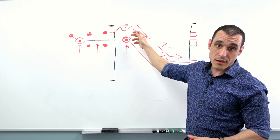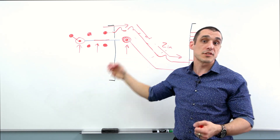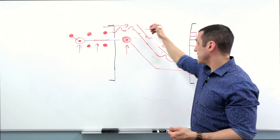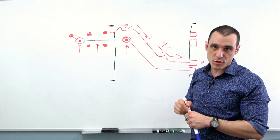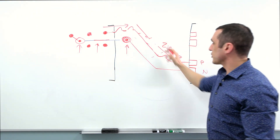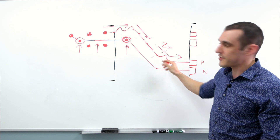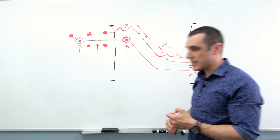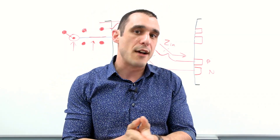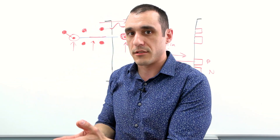If the length matching structure gets too long, you can have too much impedance deviation and mode conversion — where common mode noise actually converts to differential noise — and in that case the receiver won't be able to cancel it. So it makes more sense to space these structures out into regions where the inhomogeneities arise. Maybe you have two or three structures near the start, and later on in the route where you make a bend, you have another location to put a structure to compensate for that specific deviation. Hopefully this clarifies some practices for designing your differential pairs to accommodate length tuning without signal integrity problems.